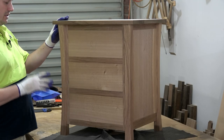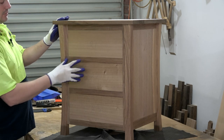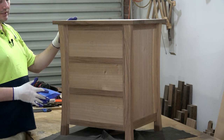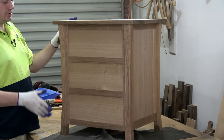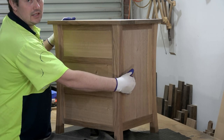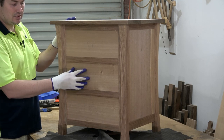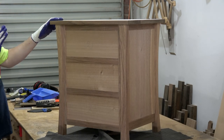That looks good the way it is, but it doesn't look as good as what it could be. Just like I've changed the top edge with a gentle curve, I'm going to change from my original plan and set these drawer fronts in from the face frame just that little bit. What that does is create another level change on the front, which creates highlights, lowlights and shadows — and that creates the interest. On the side I've got the leg, then it steps down into the frame, and then down again into the floating panel — two step downs. On the front: leg, frame, and then it steps down to the drawer fronts — creating two different level changes.